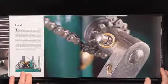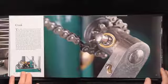When you crank a whole cycle, you can literally feel when the gears are in phase. When a rocker arm is pushing an amplitude bar upward, the crank requires more force, and when all the gears are in phase, the crank is much harder to turn.